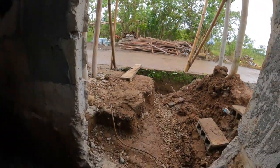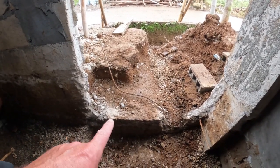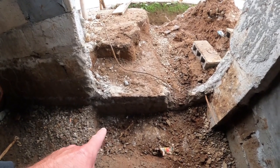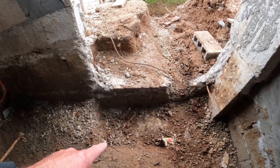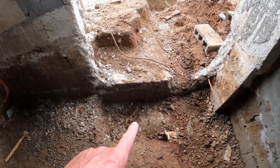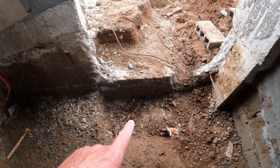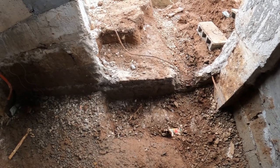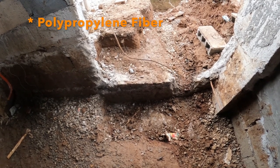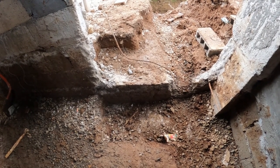We're going to have to lower our electrical boxes. The new grade is going to be the threshold of this entry door — that's going to be the new grade for the top of the concrete floor. So I have to excavate an additional amount of soil to account for compaction of the clay and compaction of four inches of gravel. I initially wanted six inches of concrete, but I'm rethinking that — if I can get hold of some concrete fiber, I may use fiber and rebar and go with a four-inch pour.